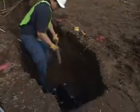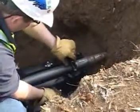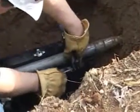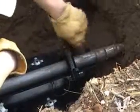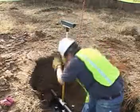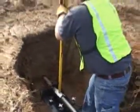Place the piercing tool on the launch cradle. Clamp the tool to the launch cradle. Rest the aiming sight on the tool body and align the tool to the aiming stake using the cradle adjustments.